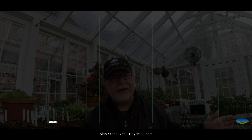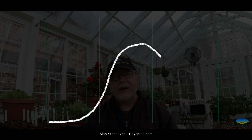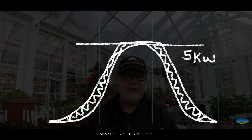I'm used to looking at solar charts where on a nice sunny day with our old system you get a nice sine wave. At the start of the day the panels are offset to the angle of the sun, going through more atmosphere, so not producing as much. You get up to midday and solar production is peaking but not clipping, then it goes back down — a nice sine wave for a completely sunny day. I thought, if I install a 6.4-kilowatt array with a 5-kilowatt inverter, I'm going to hit midday and flatline — clipping will occur. And sure enough, that's what happens.